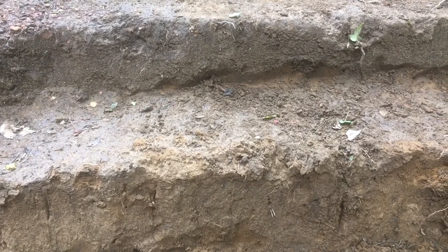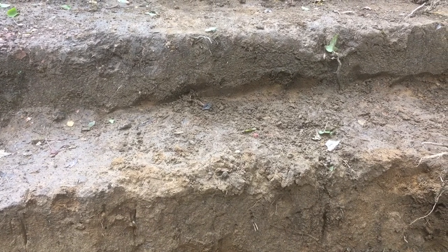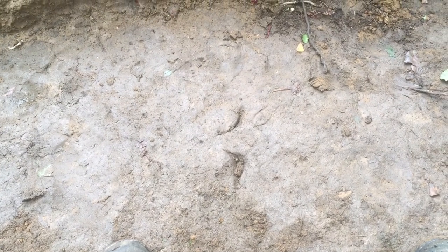So the benefit of getting these shelves absolutely level and really flat is that they're going to take a lot of weight. You're going to have stone built on top of them, and that stone needs to sit nice and firmly. The number of ponds I've seen that have had sloping sides and people have tried to stack stonework on it, of course it all just slumps and collapses into the pond and looks dreadful.